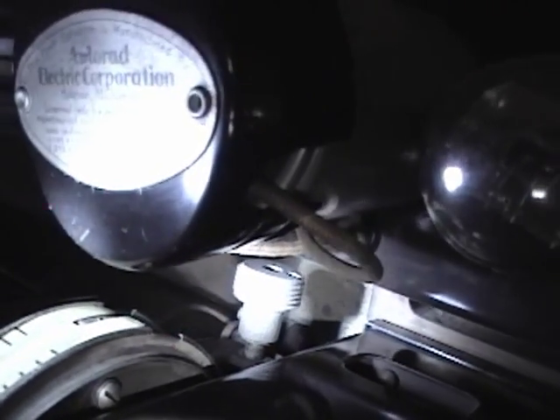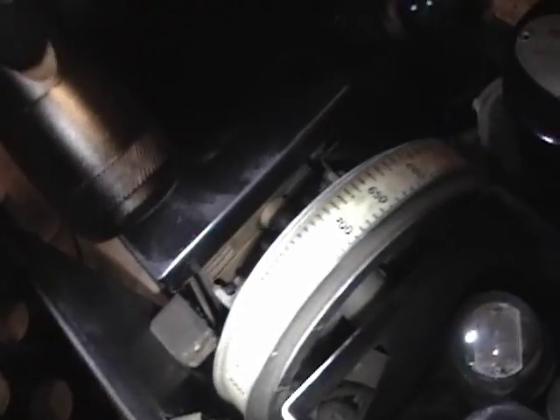Here's a closer look at the chassis. Here's that pre-selector tuning unit, which is really just a four-section, very large tuning capacitor that goes to this drum tuning dial. Mine has a problem that's apparently fairly common with this model: the tuning shaft rotates horizontally, with a pulley up front and a pulley in back connected by a wire that twists and rotates the vertical drum. Those pulleys are made of pot metal — a cheap alloy of tin and other common metals — which isn't very stable and tends to disintegrate over time, which is what's happened to my front pulley. It's really crumbly; if I put any pressure on it more bits just fall off, so I'll have to replace it somehow.